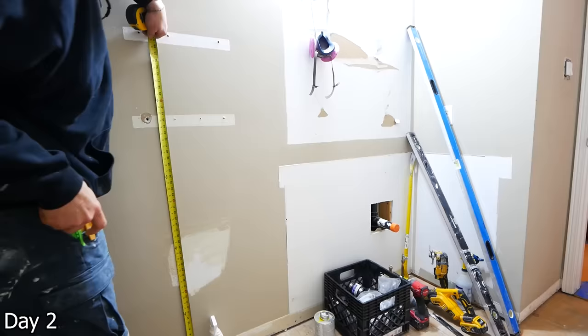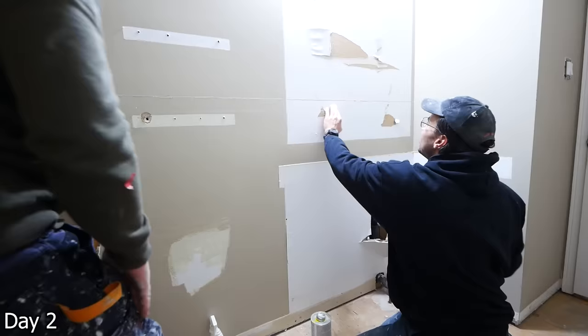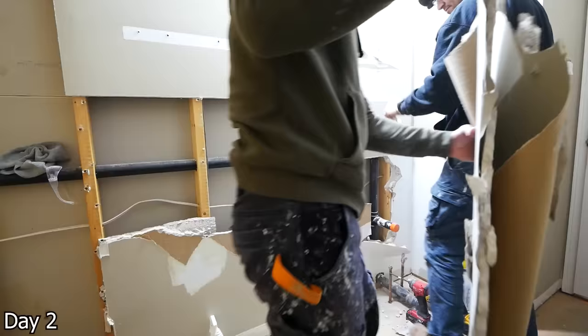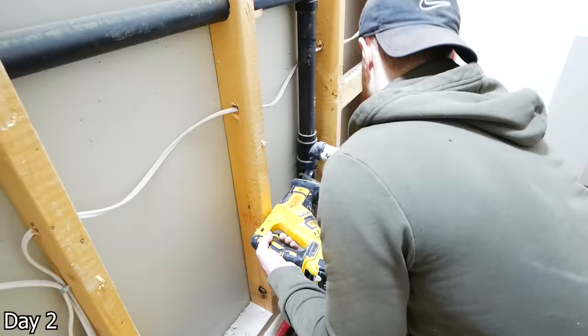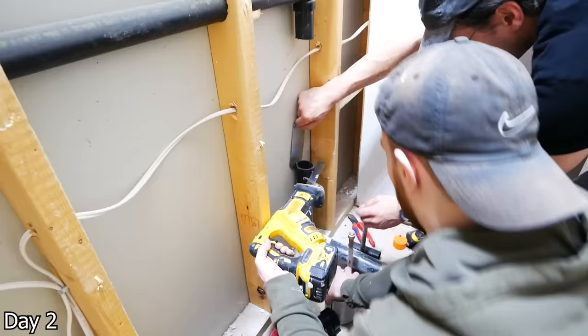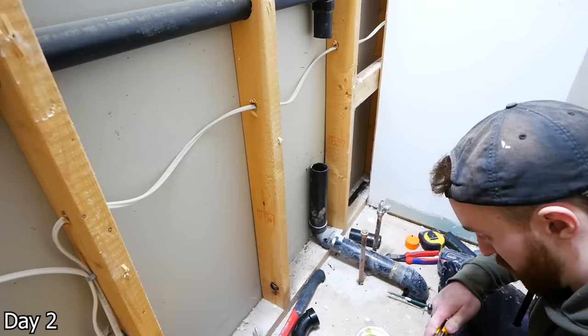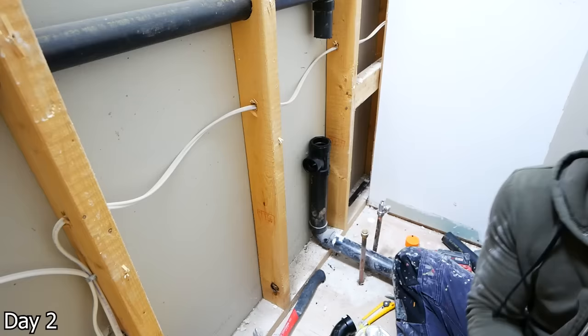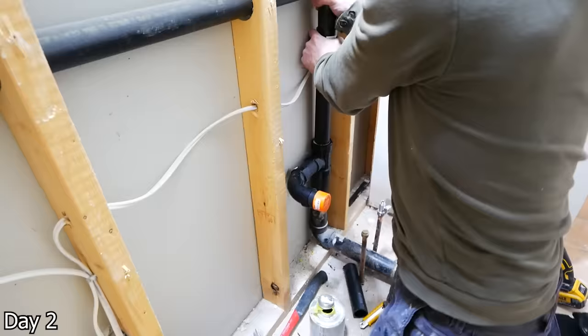Since we have to rework all of the plumbing and electrical in the vanity side wall, we're opening up the majority of the bottom half. We mark at 48 and a half inches off the floor, cut a nice line, and later put in an entire full sheet of drywall — the easiest repair giving us maximum access. The vanity drain had to be reworked as it didn't come off in the center of the vanity; left as-is it would have ended up in a drawer space. We cut it, came off with a long sweep 90, and stubbed out in the center of the new vanity space. The drain ran along the top of the subfloor, but fortunately the type of vanity we selected covers it entirely with no exposed underneath, so we could leave it without opening up more subfloor.